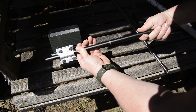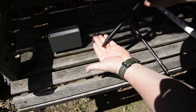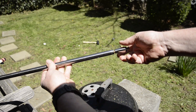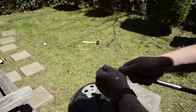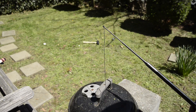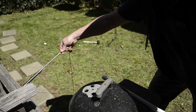I just didn't have the room. I wanted to utilize a smaller footprint since my yard is super tiny, so I just cut the length of radials in half and doubled them. The radials are soldered so I can easily attach them to the bolts on the mount with wing nuts. This little makeshift stake — I like it because I can make it smaller, and I just hammered the end so it goes into the ground easy. I got an adapter for this telescoping whip — I got this whip for 20 bucks on Amazon. Once I got it, I realized it doesn't screw into my buddy stick pro adapter, so I had to buy an adapter which cost another $20. Since this is an 18 and a half foot telescoping whip and I only need 17 feet, I can wedge that string in between the top two sections so it holds it in place.